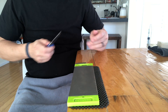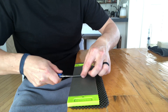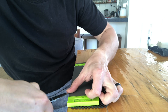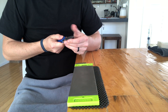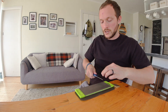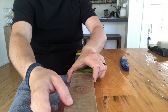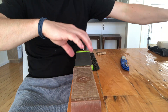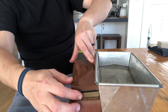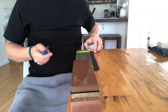The burr doesn't have to be massive — in fact, the smaller it is the more confident you can be that there's not lots of damaged metal at the apex, but you do want to be confident it's there so put in your time on this step. If your profiling is already done it makes the sharpening job a breeze. I'm switching to the King 1000 grit — the red side — first. I don't usually use a Nagura for this method, just the stone itself.